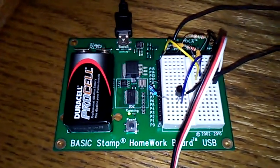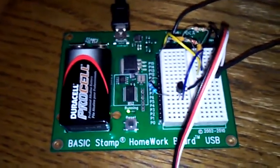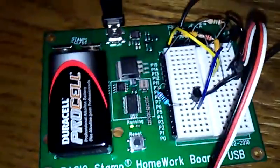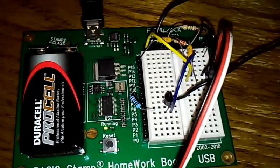Today's Basic Stamp experiment is reading musical notes just using audio input to the stamp — no fast Fourier transforms here. There's a simple microphone, one transistor audio amp going directly into the stamp, and it's just using the count command to sense the frequency. It's set up to reproduce that frequency to make a beep through the speaker — one transistor amplifier.